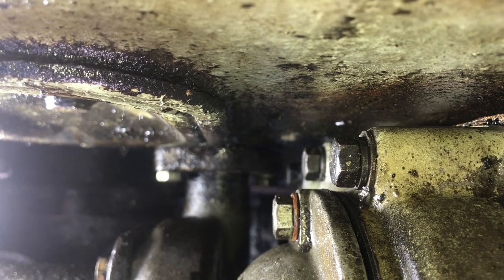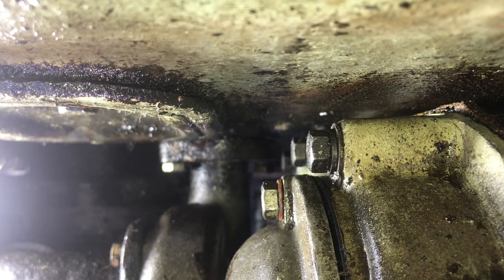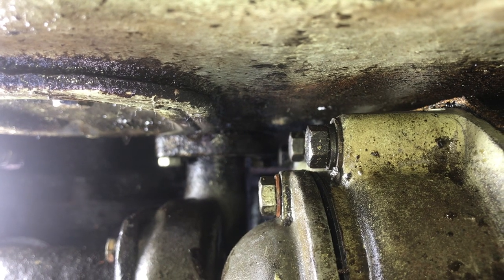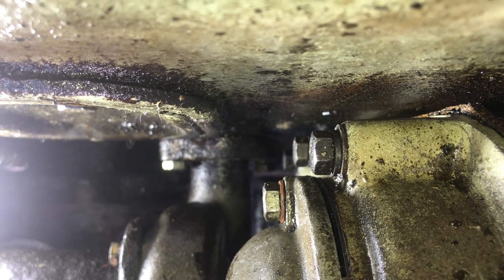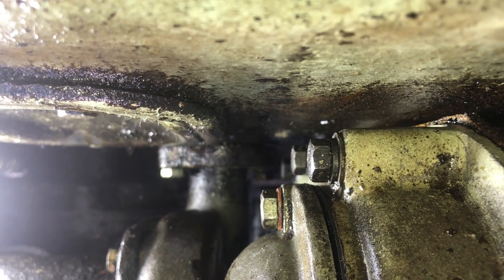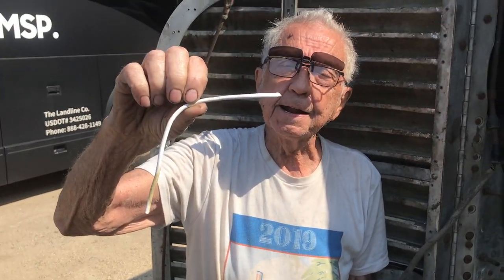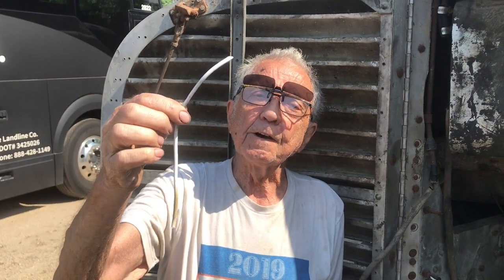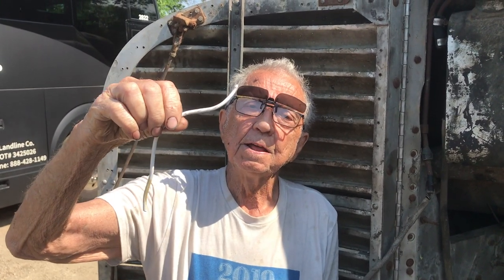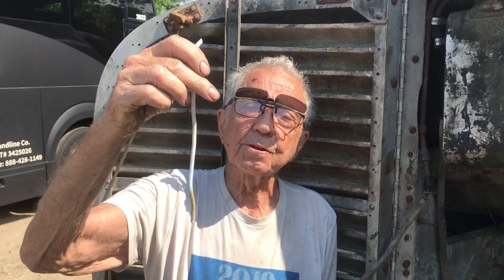fitting, that flange. This particular water pump, the outlet pipe is cut crooked. It doesn't go all the way in. So I was able to use the old flattened black O-ring along with this packing, this Teflon packing gland. Some of you old timers that have worked with radiator valves or water valves have seen the graphite packing string. This is a newer style, so I thought I'd try it.